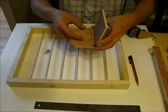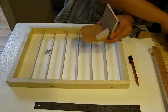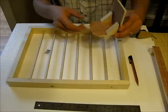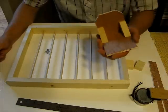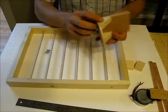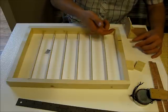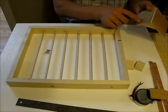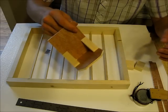Take the two pieces, put them together, and use some 45-degree angle cuts from your furring strip to glue them together and add rigidity. Pop a couple of holes here and there, put some screws through the edge of your incubator, and it's all set up. For assembly, this part lies flush against the back. Set the blocks on a table with the base piece, glue them, and pop some nails in or screw it. Glue along the blocks at the back edge, set the top piece down on it lined up on a table, and drill some holes to align it.